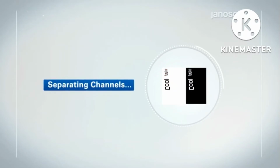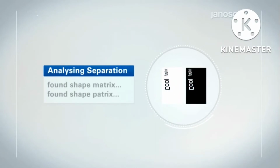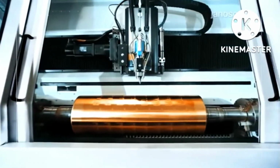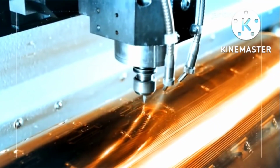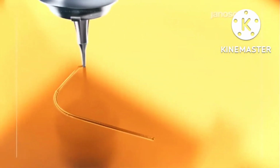The embossing technology produces a 3-dimensional tactile feature to the finished product. Embossing rollers are an essential part of Janauschka's product range. The embossing technology is highly appreciated for its wide range of applications in print finishing. This proven high quality and extensive value-adding character make this embossing feature almost a must for today's tobacco and other demanding cardboard packaging. The embossing design is milled out of the copper surface by means of a milling head.